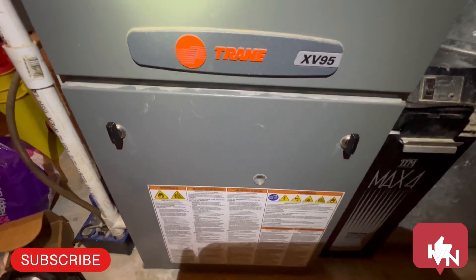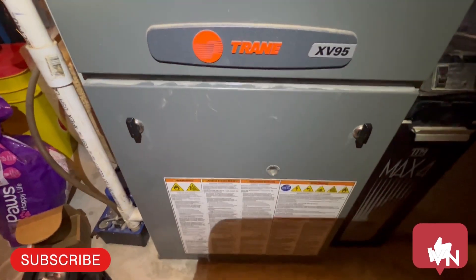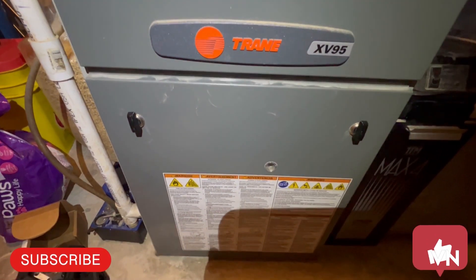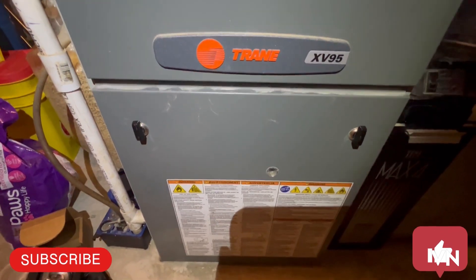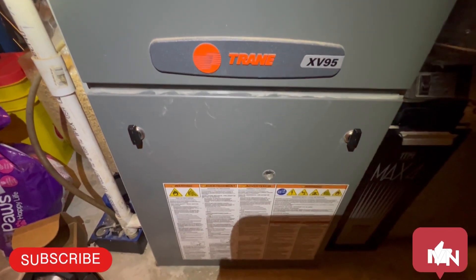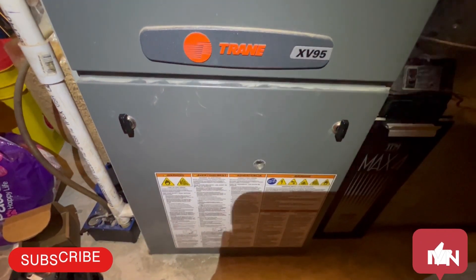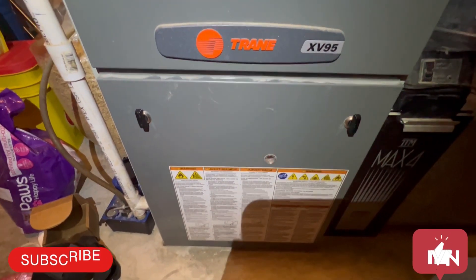I am not a trained HVAC technician — I am a homeowner. Do not take my information as professional when I'm talking about HVAC. This is my HVAC system and I troubleshot it myself with the help of two HVAC friends who guided me. They basically said follow the power: from the panel to the maintenance switch, from the maintenance switch to the transformer, and from there I was supposed to have 24 volts and I had nothing. Now I do. I am not recommending doing your own service work — if you have any problems, I strongly suggest you call a professional. Thank you for watching.